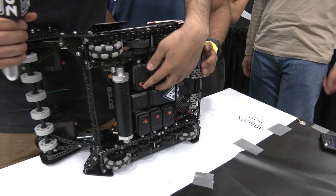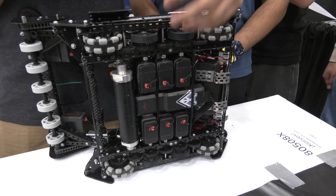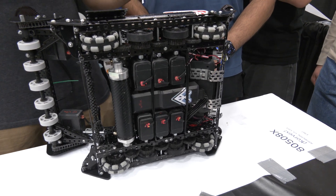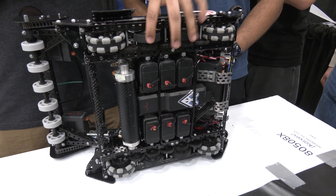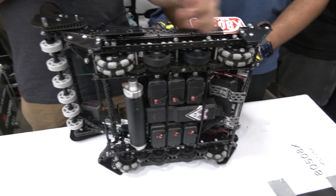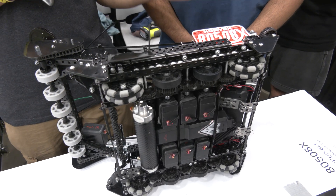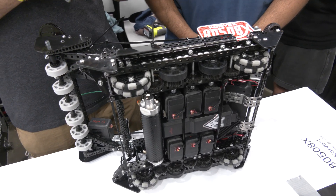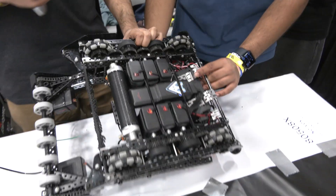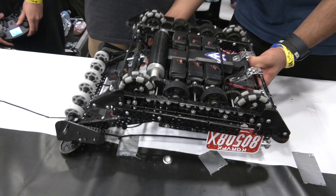So it's really fast and we're also really light with a flat bot. We have six motors — they're all vertical — and we've tried to keep our battery and our motors near the center to keep a low center of gravity. Something to help with our drivetrain is we have these two flex wheels, which make our barrier climb really nice. Coupled with these sleds that are tangent to the drivetrain, it's worked really well. We can get across the field and back really fast — we want really fast cycle times — and we're doing really well in playing both defense and offense.